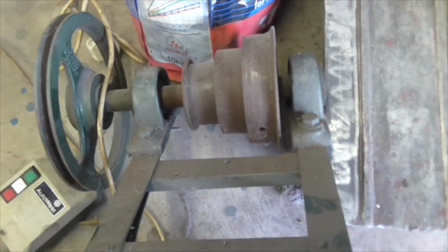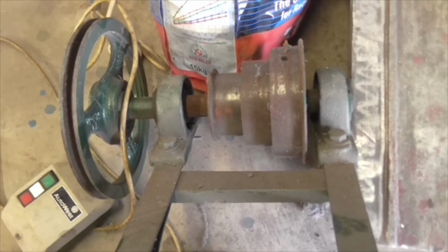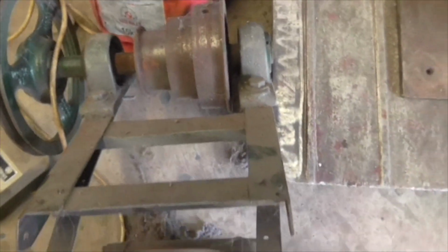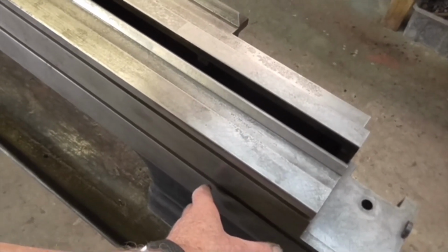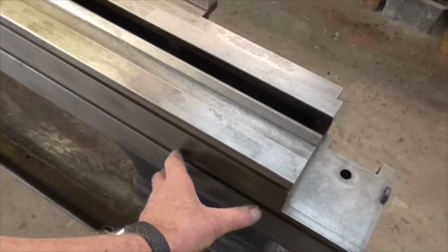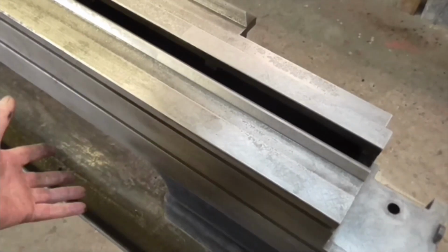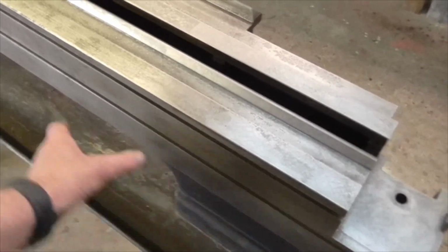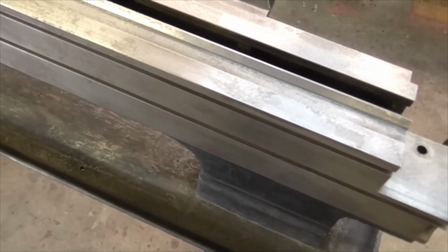But I'm going to devise a way of sliding this counter shaft sideways on the lathe so we can pick up all the speeds, because at the moment this would only have 3 speeds plus the back gear speeds, so that's got to be looked at. And I think using this T-slot on here, we can get a fixing all the way along the back of the lathe, which means we can make a very rigid fix to a strong part of the lathe without doing any damage to it, and we can then have probably a thread and a hand wheel on here to slide the whole counter shaft sideways so that all the pulleys can be lined up. On the big counter shaft on these machines, I think the upper pulley slides, but I don't know about that because it was never with this lathe, so there you go.